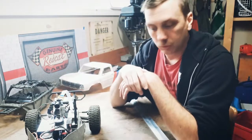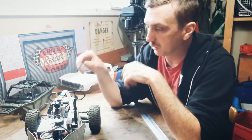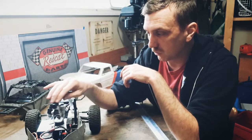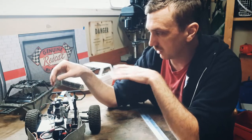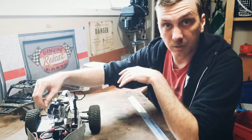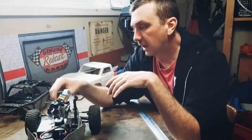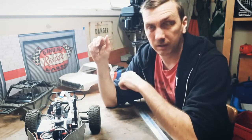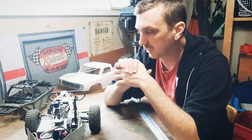The frame doesn't have unlimited range of motion — I've kept it limited, which helps during a crash so it doesn't turn itself around and yank on the cable. After a crash, if it's more or less in the right place I can press the reset on my transmitter and the gimbal just pops up and levels itself and I'm good to go again.